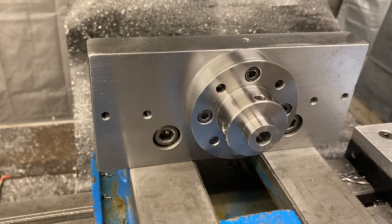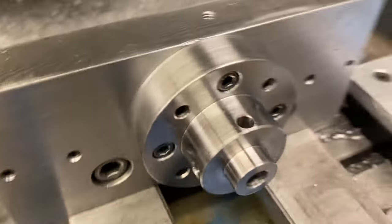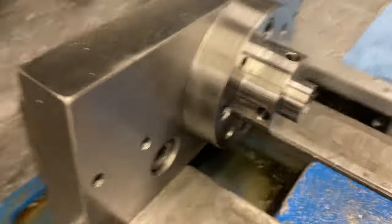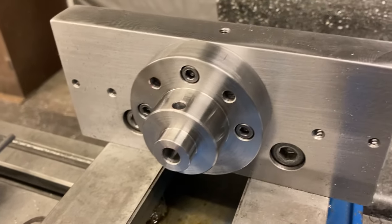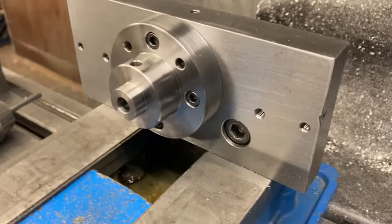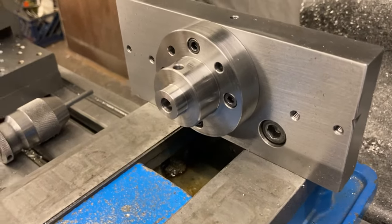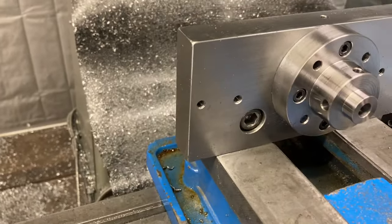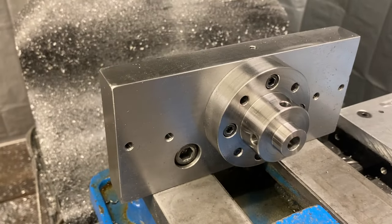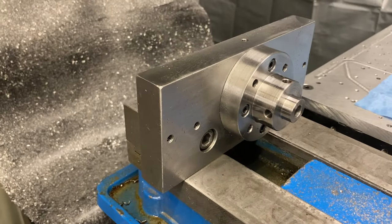Drilling them on this one. Those are two 257 and a half reamed holes right there, 90 degrees apart. I made this all ahead of time, and then I just screw it to the vise jaw — homemade vise jaw. One inch flat ground stock, low carbon flat ground stock. You can reuse that over and over again. As you can see, we got some tap holes in there — it's sacrificial, it's not hard. But it's a nice piece of material to work with to have a flat surface.